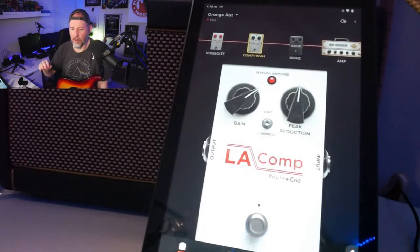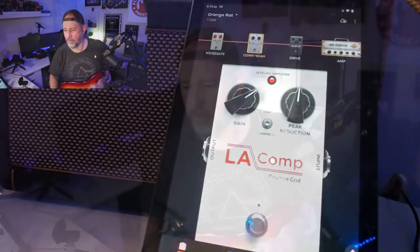So a lot of these are fixed threshold compression. So let's talk a little bit about compressors, right? Basically, they're going to do something to your signal, and you're going to tell it at what point, over what decibel level, it will start working. Okay, that's your threshold. So if you have a low signal that's not very loud and is below the threshold, the compressor does nothing. It doesn't kick in. It might add some of these artifacts. It might warm it up, those kinds of things. But it doesn't do any compressing until it hits the threshold.